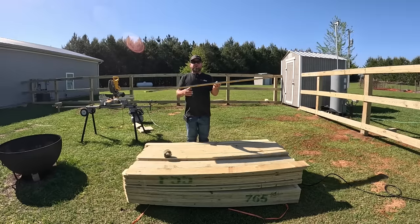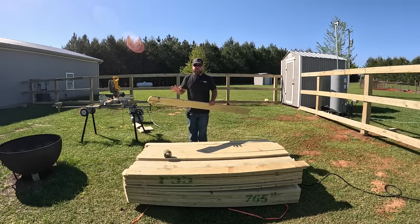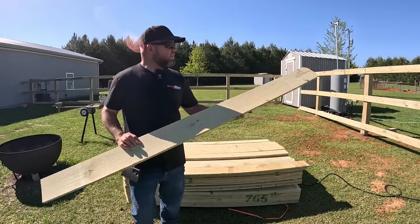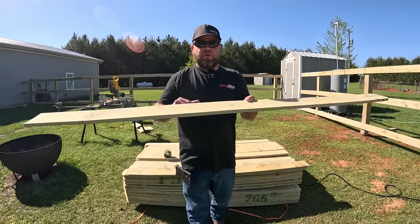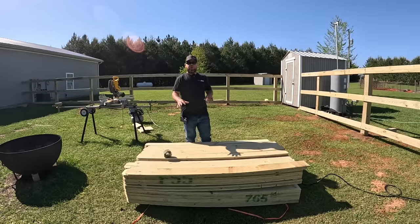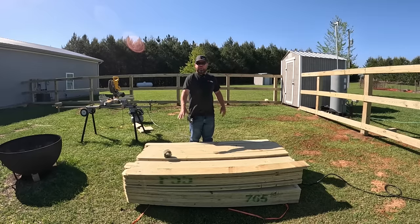You can see I just got a pallet load in — this is called a dog-ear or picket fence board. I am not going with pre-made picket fence panels because those are built very cheaply out of lightweight materials and have a tendency to pull loose and blow out. These are roughly five-and-a-half inches wide, six feet long — you can also get them in eight foot — and I believe they're five-eighths material. This is a much thicker and bigger picket than those little pre-made panels. Try to stay away from those if you can, unless you're in an area where you're not going to get much wind.